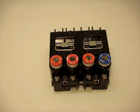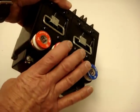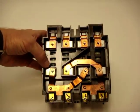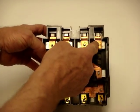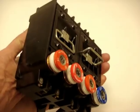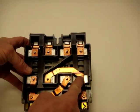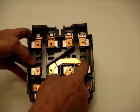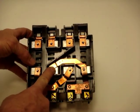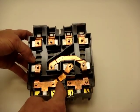This is what the fuse block looks like when it's been removed from the fuse box cabinet. This is the back of the box — note that I have it reversed, so the main is now on the right side. Power comes in, goes through the main fuse, comes down, feeds the two left circuit fuses, goes on to feed the bottom of the range fuse, and also goes down to the feeder tap.